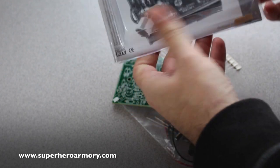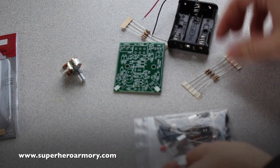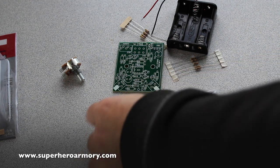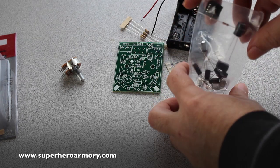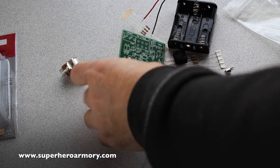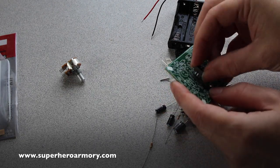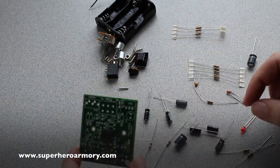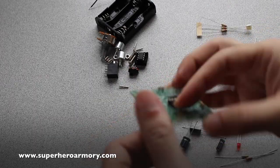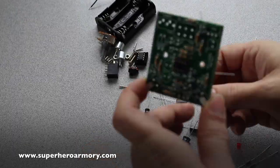The first step is to build the circuit board, and then once I know its exact dimensions I can design an enclosure for it. I need to insert all the components into the circuit board — the directions with this kit were actually pretty good so everything went together smoothly. If you're inexperienced with building a kit like this, the best way to start is to first organize the parts into groups of identical parts. It's also good to install all the resistors first, followed by the capacitors and then the rest of the components. If you get confused about the identification of certain parts, you can just skip it and come back to it later, using the process of elimination to figure out which part is which.